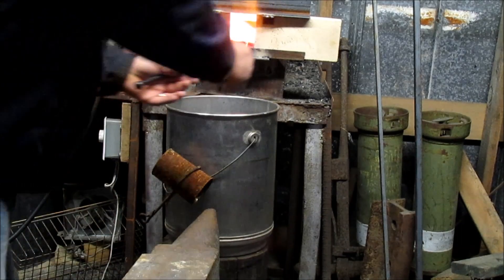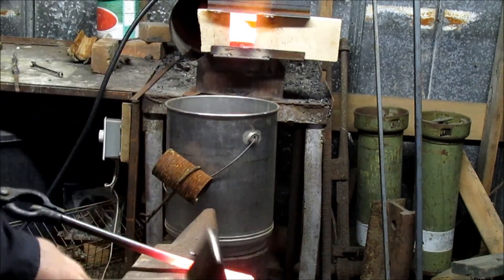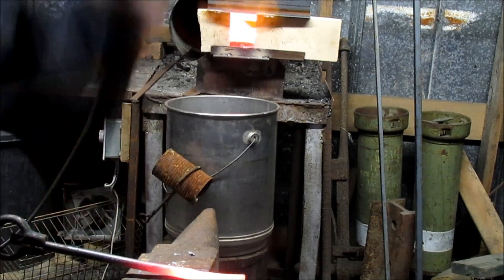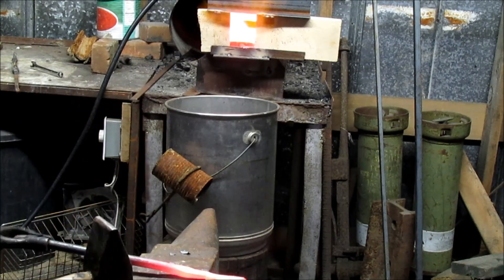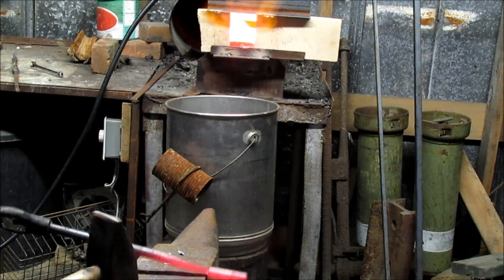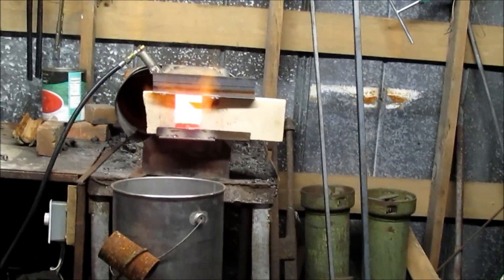Overall I'm going to say it was a successful build — it works a lot better than the first one I made. This thing gets over 2000 degrees. I did end up having to put another thin coat of kiln wash on; I think the thinner you work it the better from what I found. I've got a good working gas forge for small stuff, and I already have a plan to make a bigger one. I'll probably use this one for heat treating in the future. Hope you all enjoyed it — leave a comment, and check the description for extra details and links.